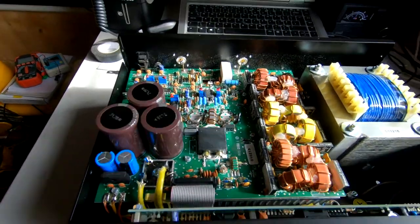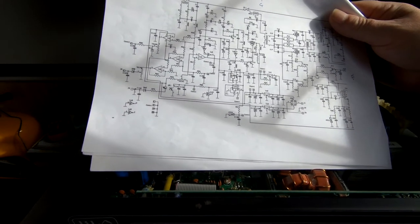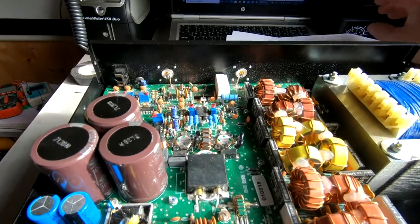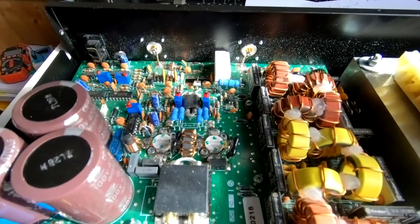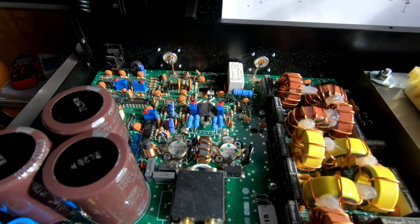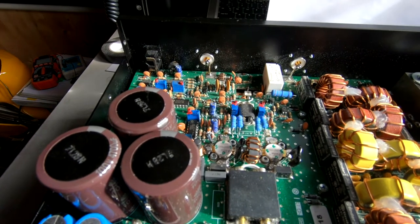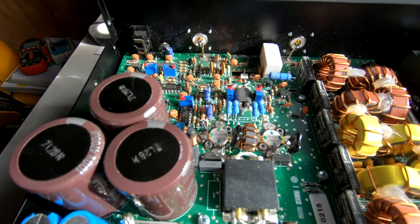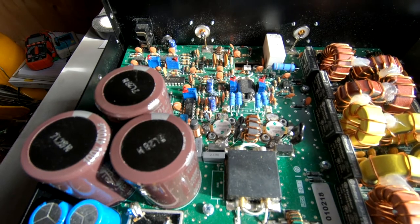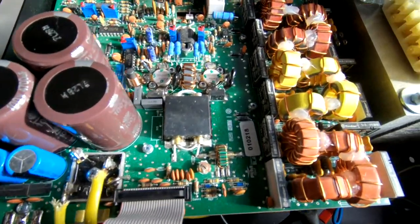We do have a basic circuit diagram, but unfortunately it doesn't tell you much. The other unfortunate thing is whoever did the screen legend - all the resistors have their designation printed underneath the resistor, which doesn't help because I don't have a component overlay, so I'm going to have to trace it through. I found a picture of the back of the board online so I won't have to take it all apart initially. If you're ever doing screen overlays on these boards, put the component designation to the side of the resistor - it really speeds up repairs.